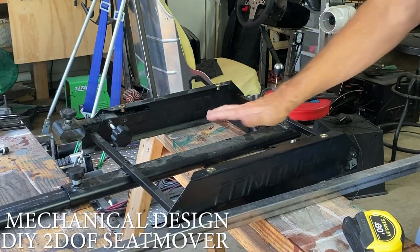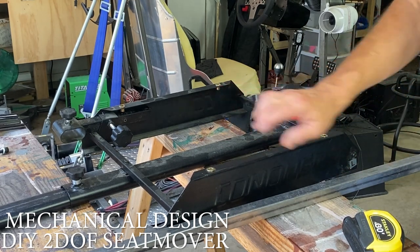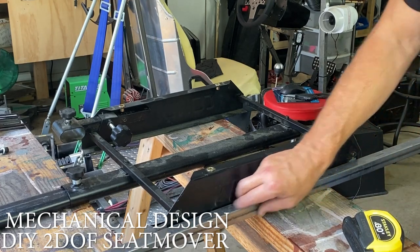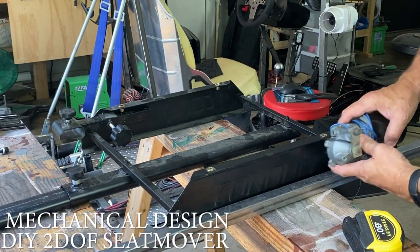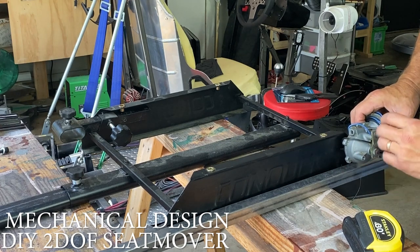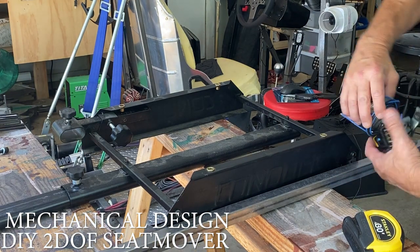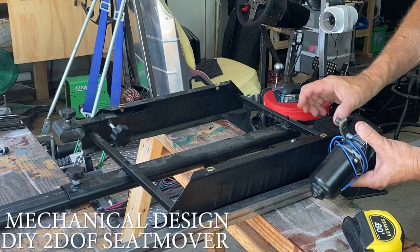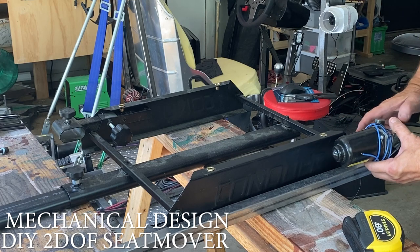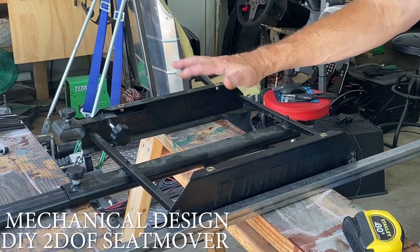The way this SimRig frame gets its stability is from sitting on the ground. I'm gonna take this inch steel and make a small frame for the motor. The motor's gonna be back here somewhere, and I just want to make sure the armature can fit around and doesn't hit the ground. Probably gonna have to mount them inwards because the potentiometers are sitting inside. We're gonna make the frame and also a seat frame that's going to attach to the U-joint.